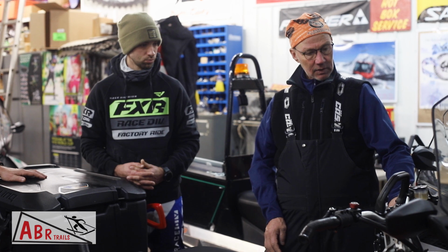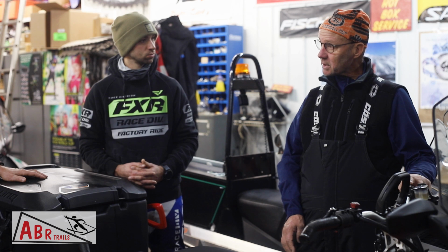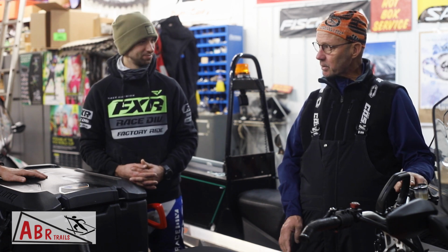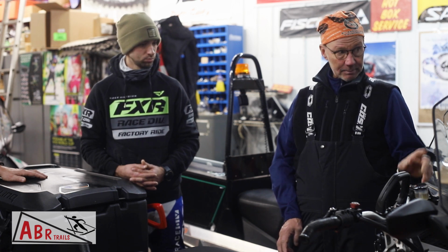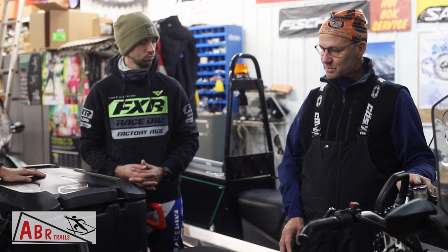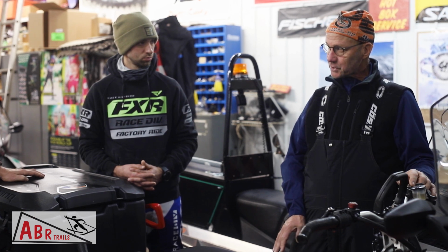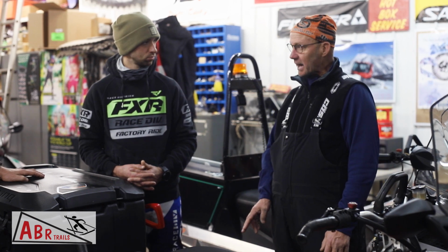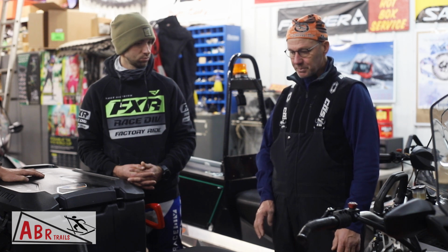Bright lights. And then the M and the S is for the gauges. I probably wouldn't recommend monkeying with that too much. Rick has them set up with the important parts like temperature, time, things like that. And both of these Skidoos are the SE model, special edition, and they come with the air shock. So we have that air shock cranked up to 5. 5 means it's really stiff in the back, and that's good for a groomer. If you're gonna trail ride, we'd put it down to 2 or something like that.